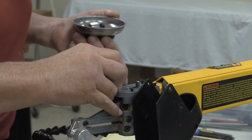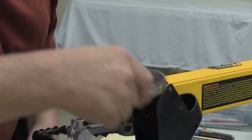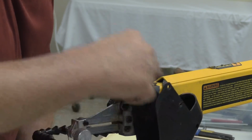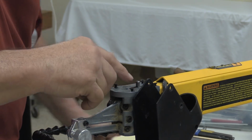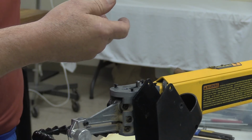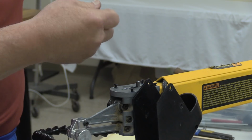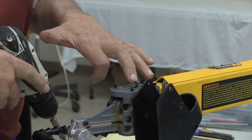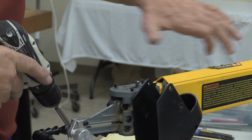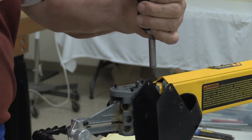Yeah, if you're looking for some more range on your blade tension, what you would do, while you've got this thing off, is grab the end of this thing with a pair of needle nose and just give it a twist. No more than about two. You're twisting your tensioning shaft, your draw rod that goes back to that wedge in the rear.